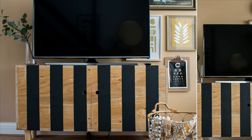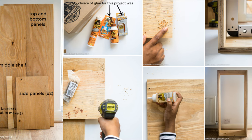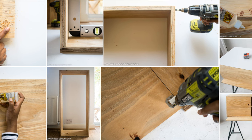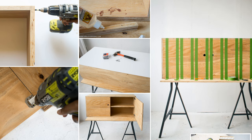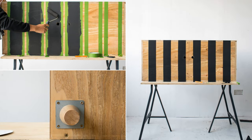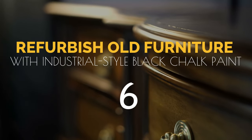Number 7: an easy DIY TV stand project idea for the entertainment center. This TV stand is pretty straightforward. Begin by measuring and cutting the wood — you could have them trimmed or do the job yourself using a circular saw. Pre-drill holes and make a rectangle box, then insert screws and install cabinet hinges. Add the middle shelf for additional support by creating brackets before nailing in the backing. Insert holes for the door handle. After attaching the legs the job is done, but if you want striking stripes, do the painting before attaching the legs.